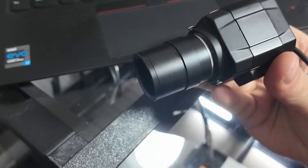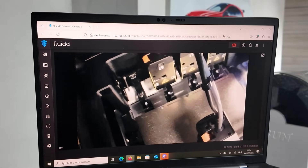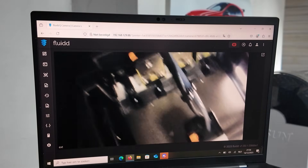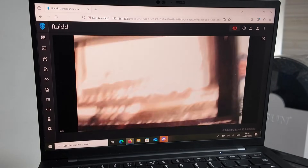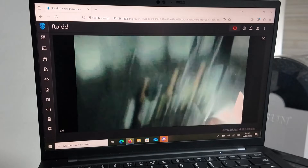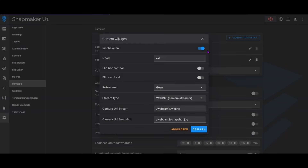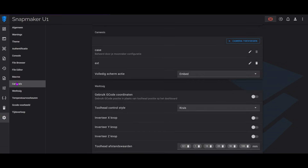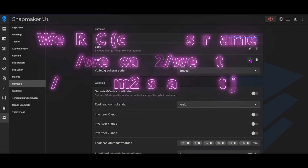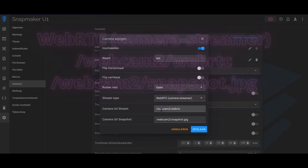The second part of this video is an update on the external camera feature I showed in the last video. We've been testing it extensively, and I'm happy to say it works exactly as intended. The firmware automatically detects an external USB camera as soon as it's plugged in — there is no complicated setup on the firmware side. All you need to do is configure it correctly in the Fluid UI. On the screen right now you'll see the exact camera settings I'm using in Fluid. To get the best video feed, add a new camera in Fluid and apply these settings exactly as shown on the screen. Once configured, the video feed is stable, responsive, and perfect for monitoring prints remotely.